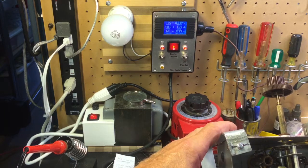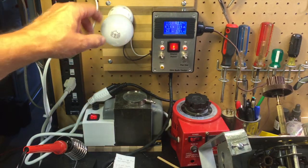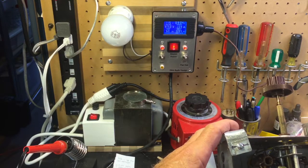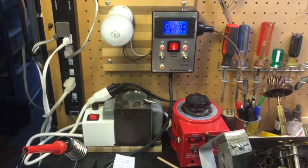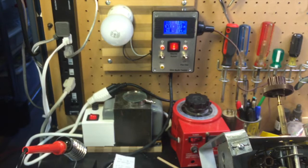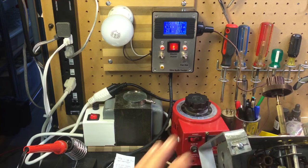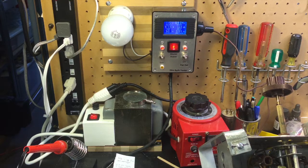That's kind of fun. But if you don't have one of these, which is the cheapest safety investment you can make, potentially you could blow it up. Potentially you could melt down a power transformer, the audio transformer. You could explode old electrolytic caps. You could even explode old non-electrolytic caps. This dim bulb tester limits the amount of current that radio can draw, and if it draws too much, it in essence shuts itself down, thus avoiding fires and things like that. The usual stuff.